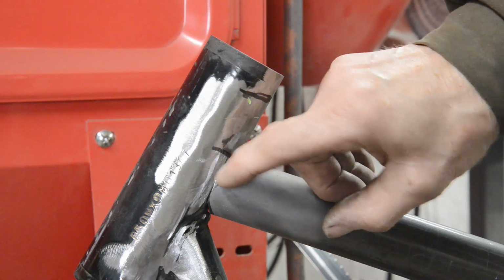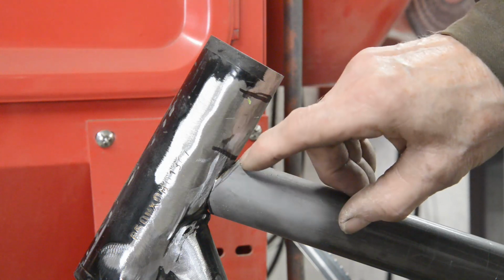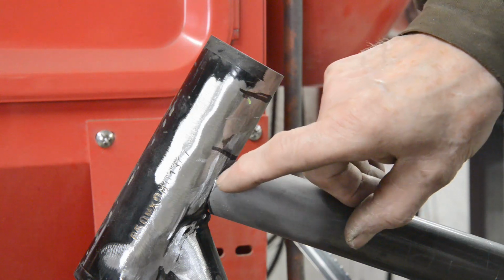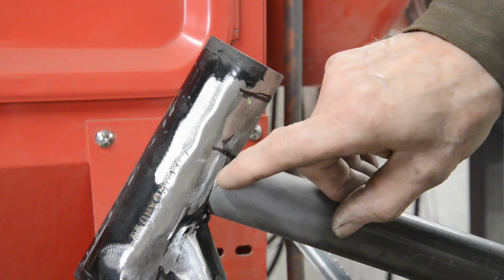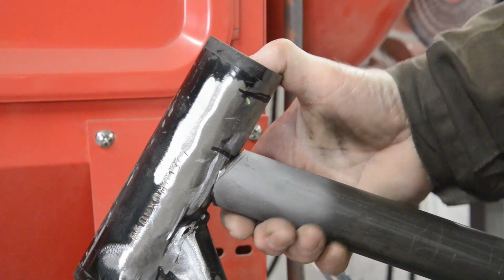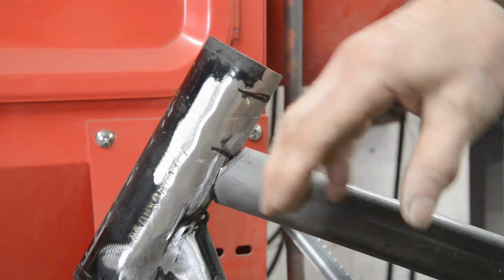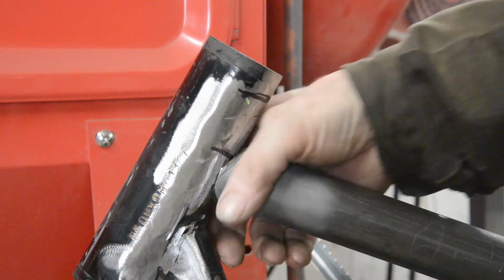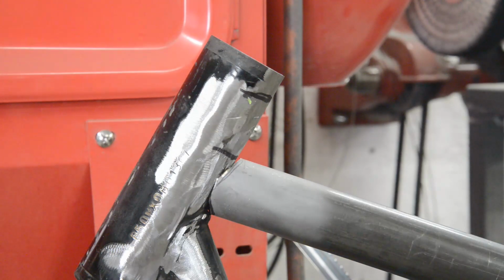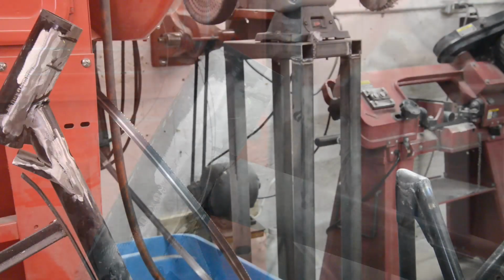So what I've done is I've cut it out, given a little bit of extra metal there, so I can slowly work my way back. Because if I'd cut it to that and it had been wrong, I'd have been really annoyed. So you just take out less than you think you're going to need, and then gradually work your way back. That's why I say it takes its time. And there, as I mentioned, you can push it in a little bit. It'll give slightly, because we don't want to change the head angle, but we can just make sure it's okay. Alright, so let me beaver away with the file and the grinder and gradually work that up to there.